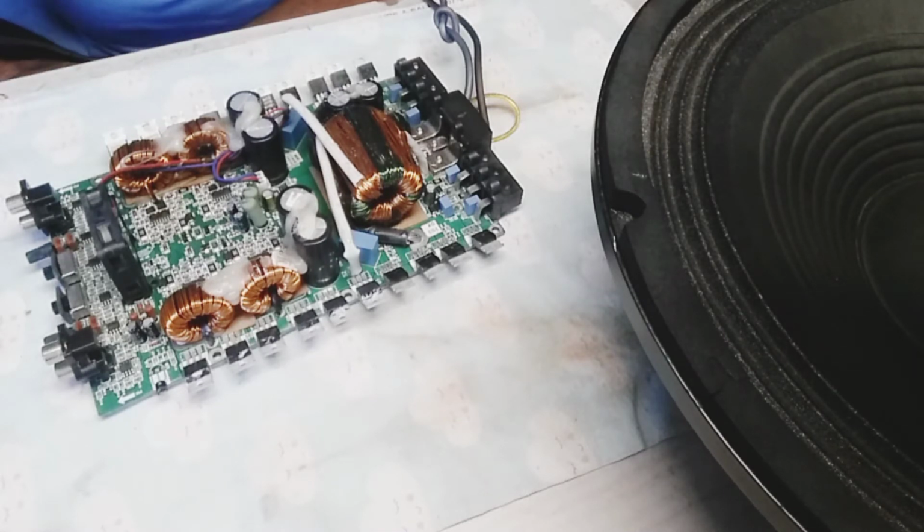That's why a lot of times I try to modify these amplifiers. They come with a resistor at a certain part. I see they have some surface mount parts sometimes running really hot. I upgrade to a higher wattage, because come on, why would you put that? Sometimes it starts to bake the board. Like, come on.